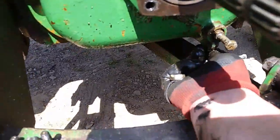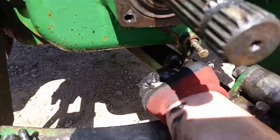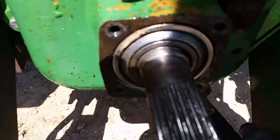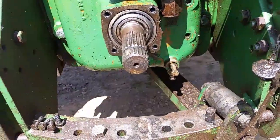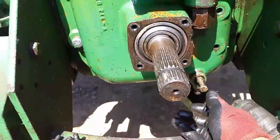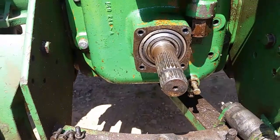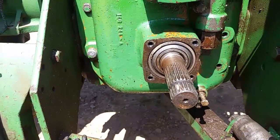So get it in, find the groove, and then you're shifted to a thousand. In is one thousand speed, out is five forty. And if you don't have this shift rail, then you've got a single speed unit — whatever you got is what you got. It could be single speed 540, could be single speed 1000.